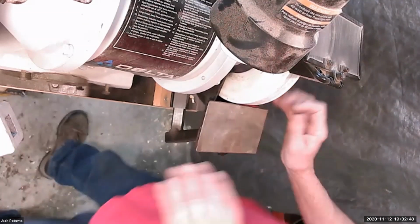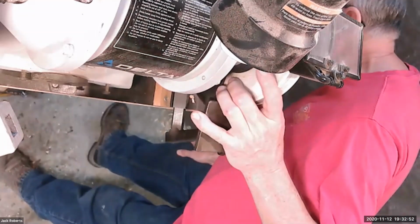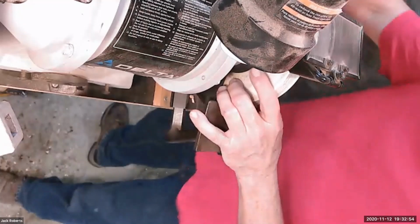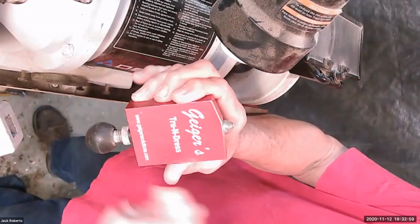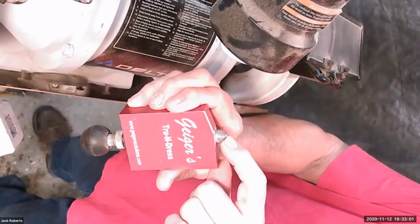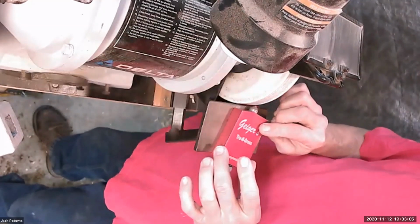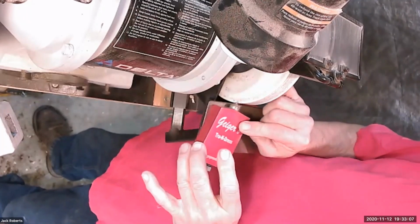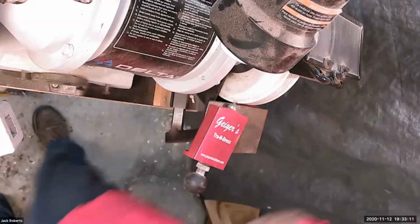Okay. So what I do to true my stone up, and I'm going to show you this, is this is one of Don's products here. It's an industrial diamond here in the end. It's designed to sit here on the tool rest like this and slide back and forth and clean this wheel. Now, I am going to clean it a little bit because it needs to be cleaned before I sharpen tonight,